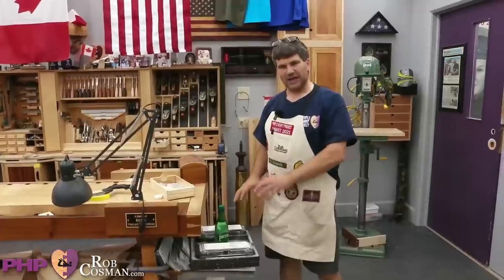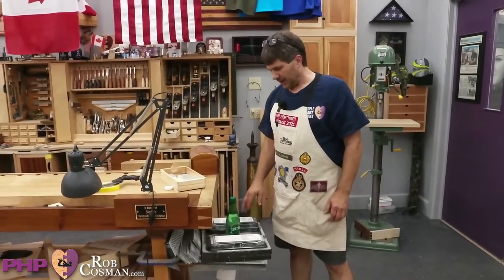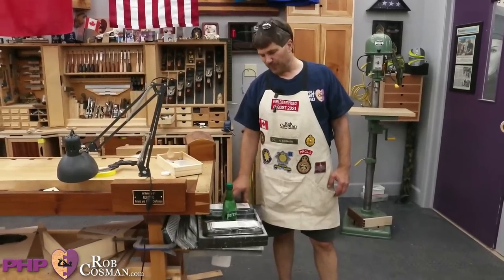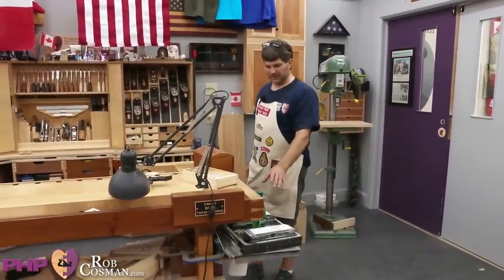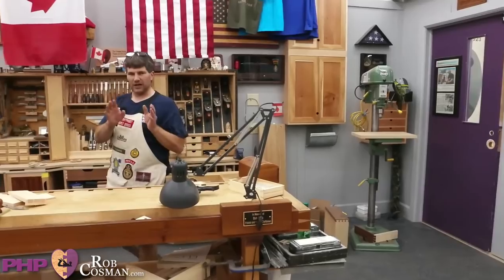If you've got lousy stones because you didn't want to spend the money, you're going to deal with subpar results. I always encourage people, spend your money wisely. Don't scrimp on your stones. The better they are, the better you learn to use them. It's not difficult. I teach this in the first half day of our class. Once you master this, I go up to 16,000 grit, and it'll put an edge on these tools that gives you a flawless surface.